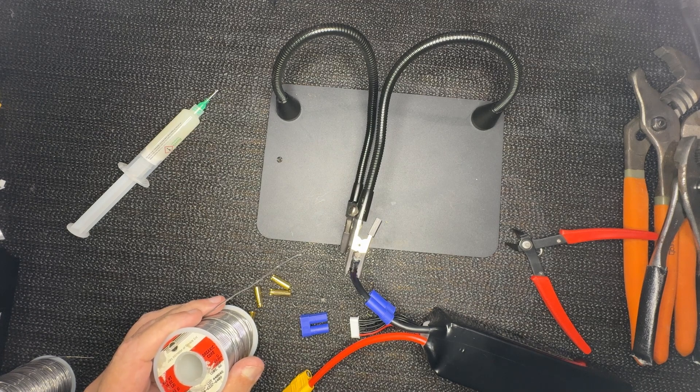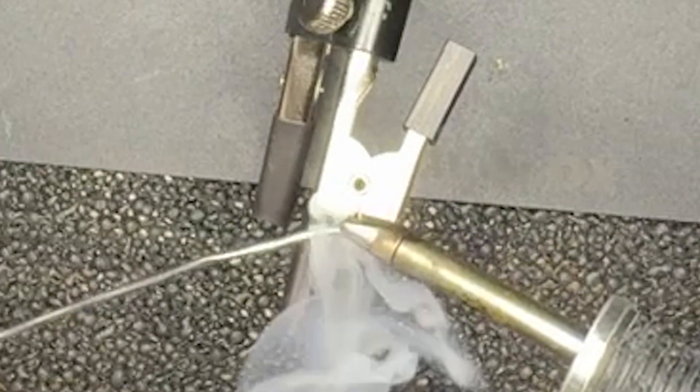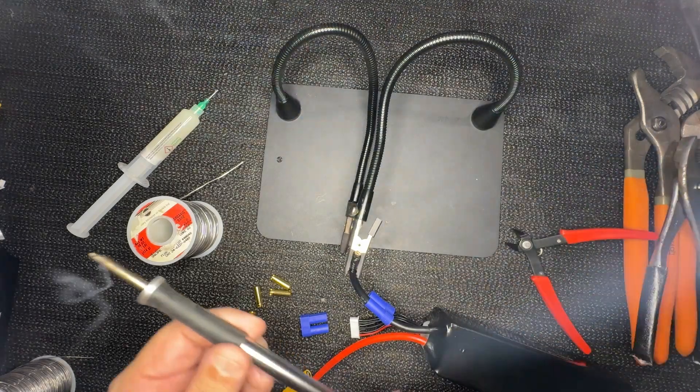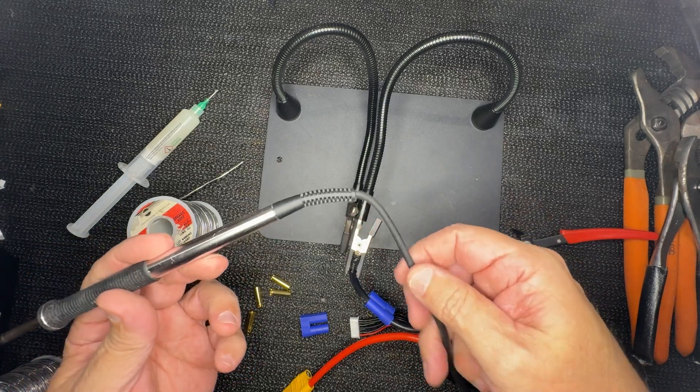So for this one we're going to use the tip I showed you. Let me clean the tip. I put a little bit of solder like this — and, I don't know if you noticed, it's instant. The way this thing works is instantaneous heating. That's all you need to do to tin this wire. By the way, this is actually a coaxial cable, and the connector is exactly like the cable TV type that goes to your TV or cable box.